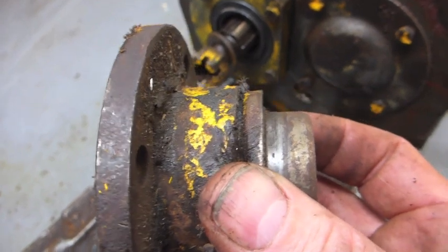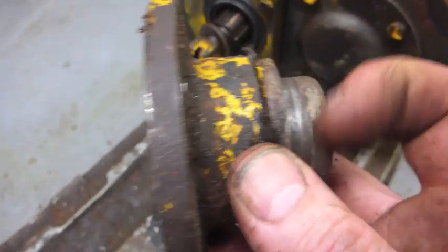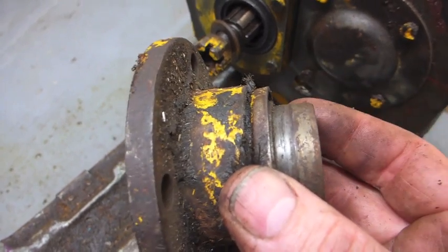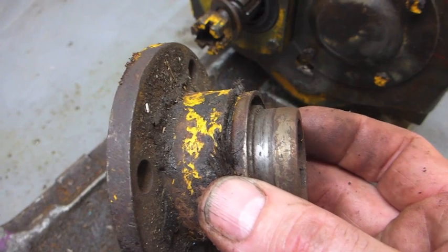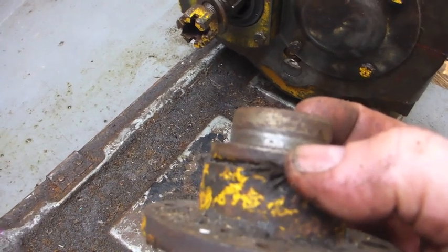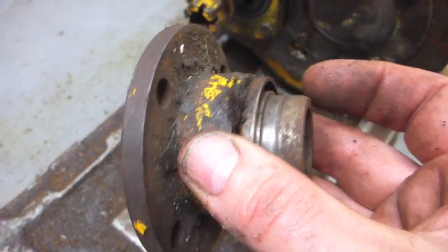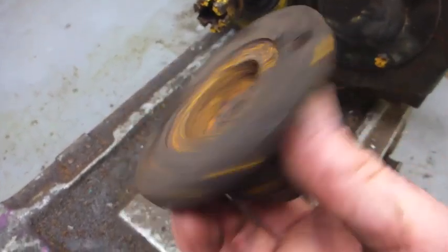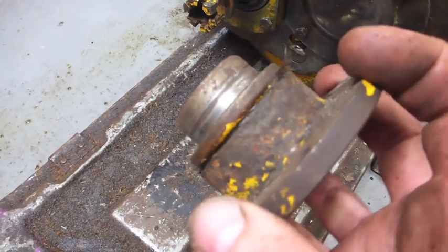There's such a thing as a shaft repair kit — about £15 each, which seems like daylight robbery but the hassle it saves you. Basically it's a really thin sleeve made of ground, highly polished stainless steel. There's a little top-hat rim on there and you tap it on using the rim. Once it's on, the top hat pulls off on a pre-indented line, exactly like the ring pull on a can of Coke. So you tap it on with a little device they give you and then you tear off the rim, and it presents you with an entirely new sealing surface. These shaft sleeves are really thin — less than half a millimetre — so it won't affect your choice of seal. Your bearing stockist — anyone who sells bearings — will be able to sell you a shaft repair kit.